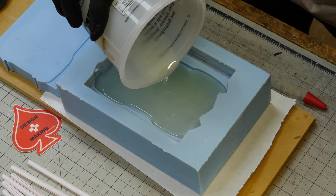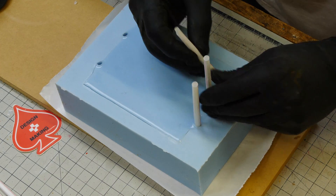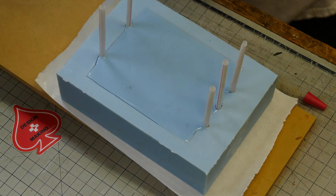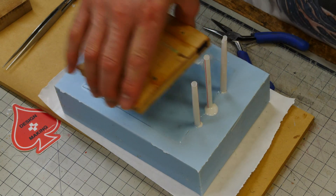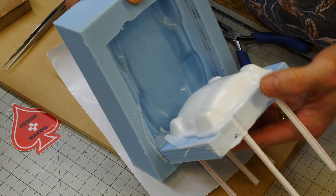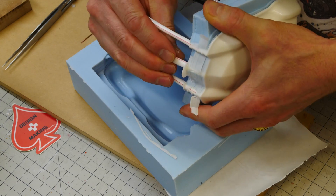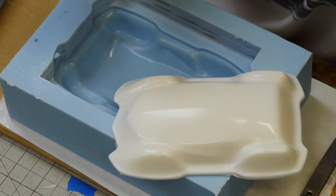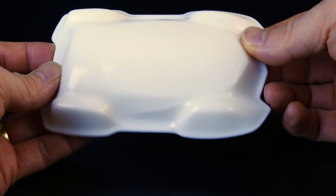Now pour it into the mold and let most of it fill up. Put the top on, use some straws for the sprues and vents — these are the overflow fills. Tip the mold and use a syringe to pour in the rest of the resin and fill the cavity the rest of the way. Add a weight and after a couple hours you're able to demold and get a nice urethane part. Use flush cutters to remove the sprue and vent — a very nice white plain part.